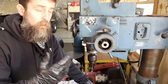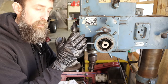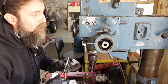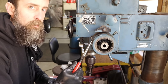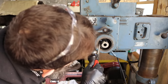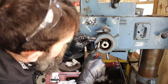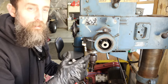I did take off several fasteners I wouldn't have had to, but really I was just trying to feel my way through this thing and see what loosens what. Potentially we may have got lucky, because what I found here is a mangled spring — I'm sure that's just not supposed to hang in there like that. Chances are that does something with this little dog here, just a little latch that engages or disengages the power feed. That could be the whole reason why this thing didn't work. So maybe we got lucky.